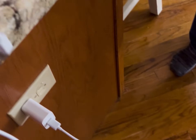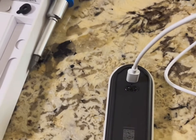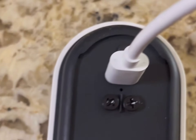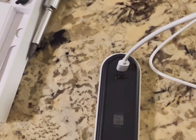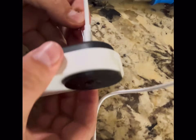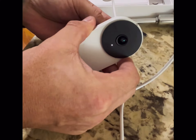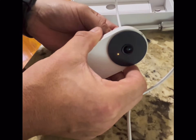Next, we have it hooked on to power and we're going to connect the USB-C to the back. After it's charging and you've brought it inside, the one thing the box doesn't come with is a small device for the little pinhole right there — that's where you hold in to reset the device. You need to reset it in order to learn it back in. A lot of people don't do this step and then it's never going to learn in. So push the button, hold it in — the little light comes on but you keep pressing it. You want to hear that little ding noise, and then you can take it out.